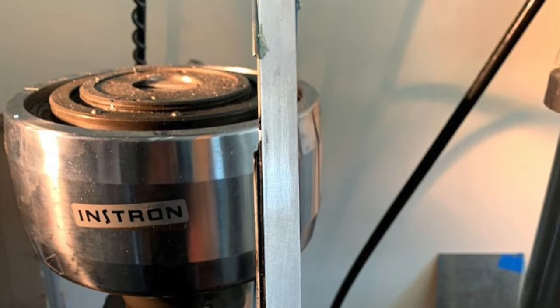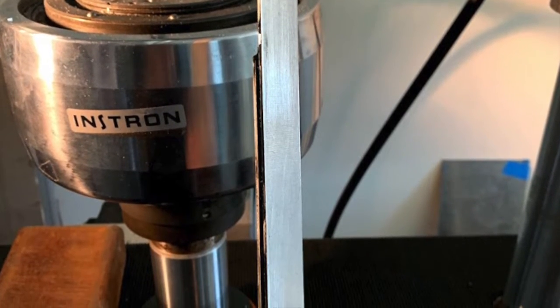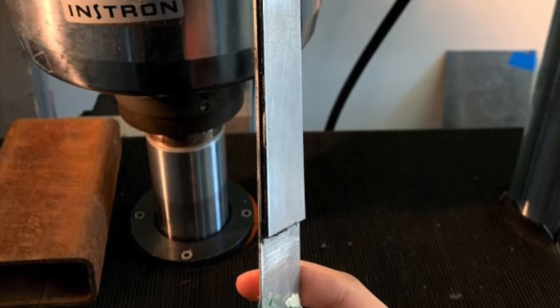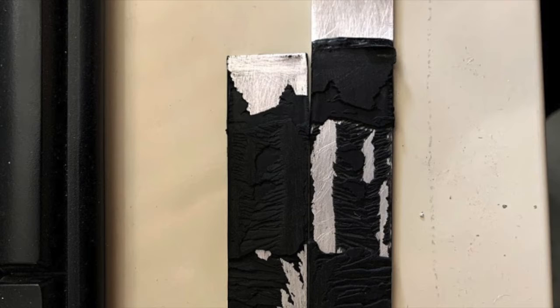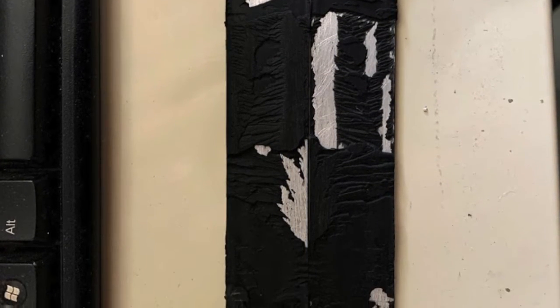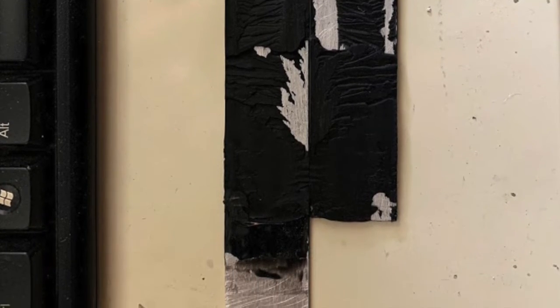We performed yet another test per ASTM D1002 adhesive lap joint shear testing, fixturing composite lap shear joints in an Instron. The tensile test results provided an approximate adhesive strength of our prototype VEM. Using the results of the FlexSeal tests, we were able to translate the shear strength of our prototype VEM to predict the shear strength of the actual VEM in our assembly.